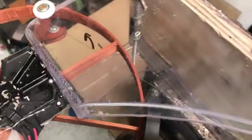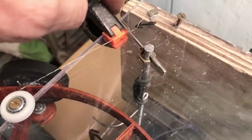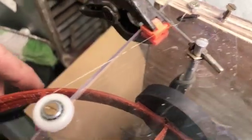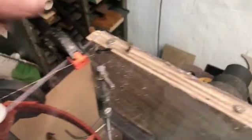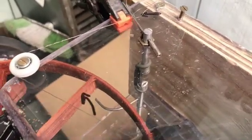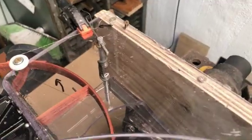The whole assembly has the magnet clamped so that I can turn it. I played around and found the range where it's 90 degrees perpendicular to the wheel when a magnet enters. Then when it's in the middle, it briefly turns this way and propels the magnet further away. If it's only at that angle, the magnet comes in and goes around — you can see it goes up to there. But if it's turned the other way, there's more resistance and the magnet gets propelled further.